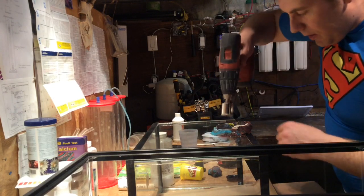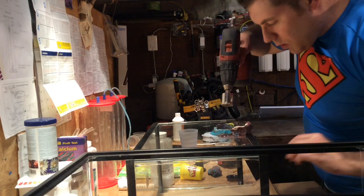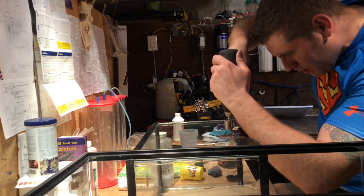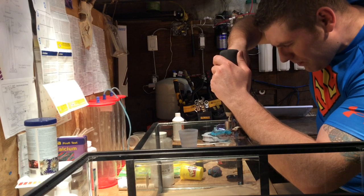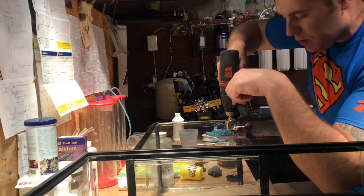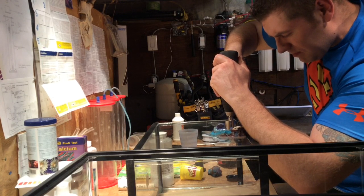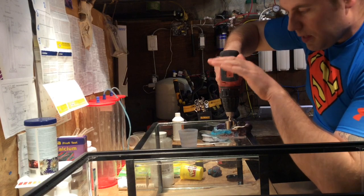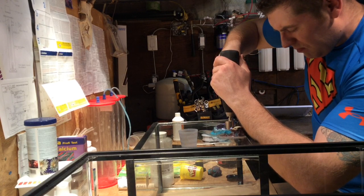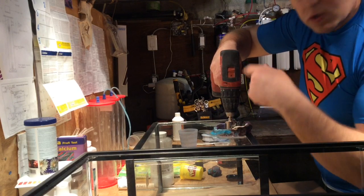So I got some water here — I'm going to pour this in. See, with your black marker it won't come off. So you're going to take your drill and try to get it as straight as you can. You've got to keep it on an angle to get it started. Just start slow. You want to get a groove started because it's not like a wood bit — it has no pilot bit, so you have to get it started on an angle cutting through the glass. Slowly keep moving the hole saw to straighten it up. The water inside the little dam keeps the diamond tip nice and cool while it's drilling through the glass.